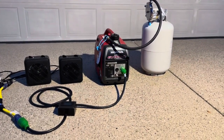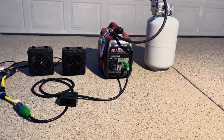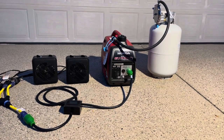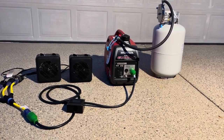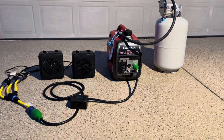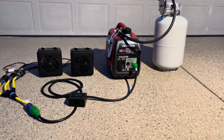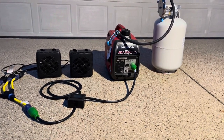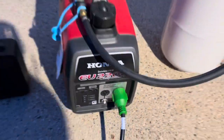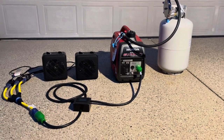Overall summary: we saw the voltage drop to slightly over 100 volts. Max wattage was slightly over 2000 watts. Even though this generator is rated at 1800 watts running, it ran at 2000 watts for quite a bit — going over its 1800-watt running rating, which is pretty impressive. Hertz held steady at 60, which is great. Peak amperage was about 20 amps, which matches this generator's 20-amp rating. So with it converted to propane using our tri-fuel kit, it looked pretty good.